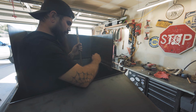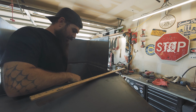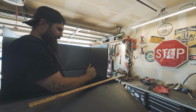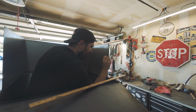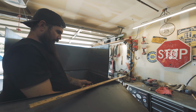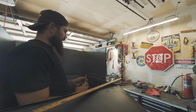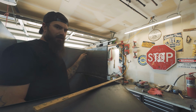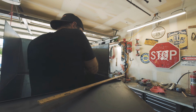So what I'm doing is going through and marking our measurements down to be kind of equal, and then I have to go across now and give my measurements. So our first and third, second and fourth. First and third are going to be spaced at 2, 6, 10, 14, and 18 inches apart to give them the proper spacing. After I do the grid on this side, I'll have to transfer it to this side. And all we have to do is basically weld on each mark with each piece and go from there. It's going to get a little tight though.